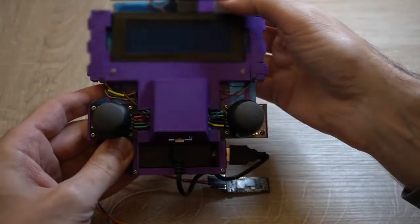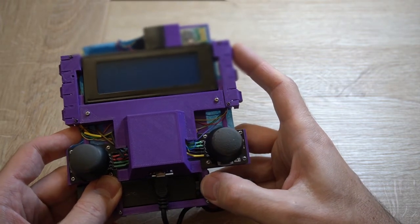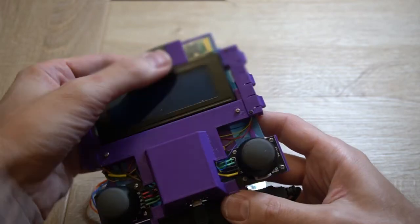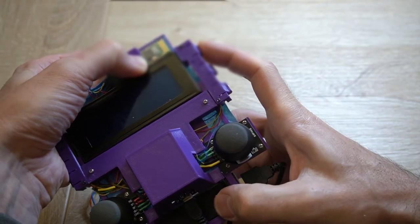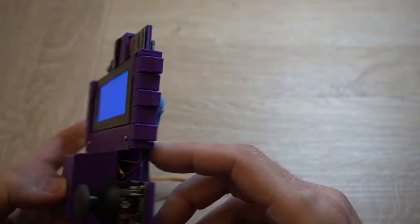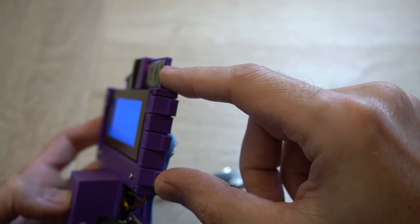In my remote controller, this tiny button is pressed by this larger button. I also use this button to tell my Arduino that the controller should start not in remote control mode but in binding mode. So I press the button on the Bluetooth adapter and the button for Arduino and power it on. After that, Arduino goes to the special mode, changes the Bluetooth adapter receiver, and we can see that the Bluetooth adapter is currently running in AT command mode because the red LED is blinking rarely.